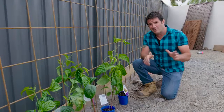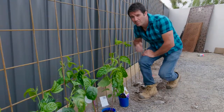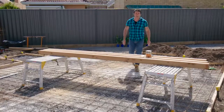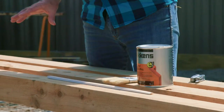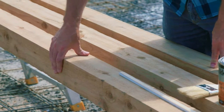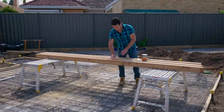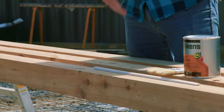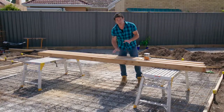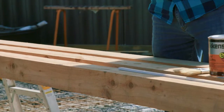First things first, I'm going to paint my posts. Once they're painted we're going to come back and dig the holes and I'll show you how to build a screen. Here's our cypress post — I've gone for rough sawn cypress, which means it hasn't had that final machining down to a 90mm post. It's 100mm, so I've still got 10mm of skin around the post and it's rough in texture. That really protects it from weather, rotting and whatnot, so it's a great idea when working outside — rough sawn cypress stays straight and stays in the ground for a long, long time.